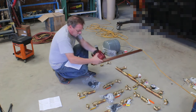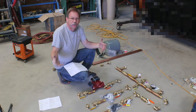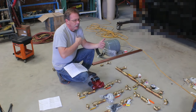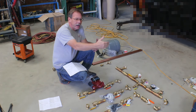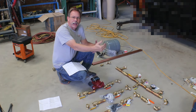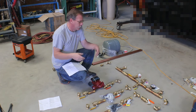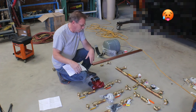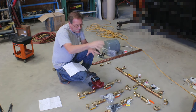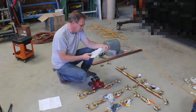You can watch your flow rates or your temperatures to see if you need to turn up the speed or slow it down. How long does that fluid need to stay in the floor to actually get the heat out of it? If you're pumping it too fast, you could have your temperature going into your floor at, say, 130 degrees, and through very short loops it might be coming back at 120 or 115 degrees, which means your floor is not taking the heat out of it, or your floor is already at 120 degrees, which I don't think we're going to get to. By having that ability, I can adjust each pump to the manifold and circuits that are behind it.